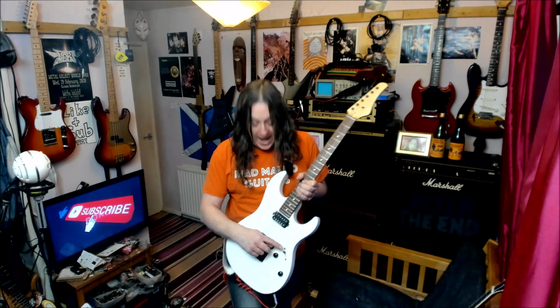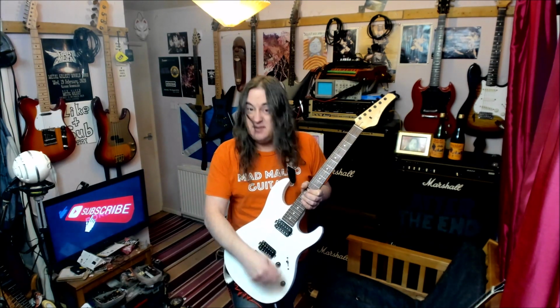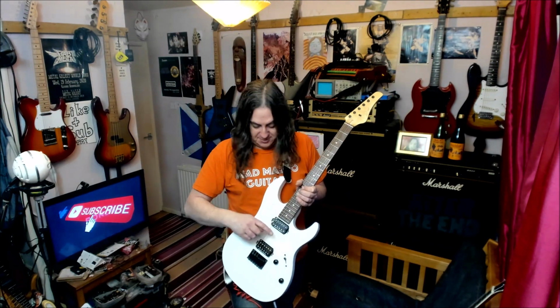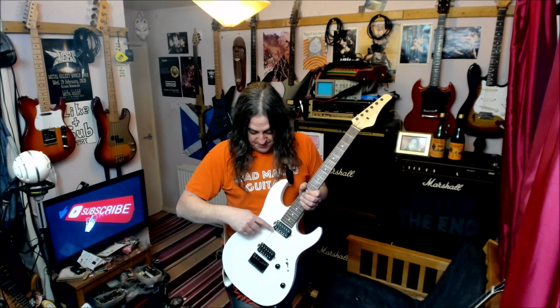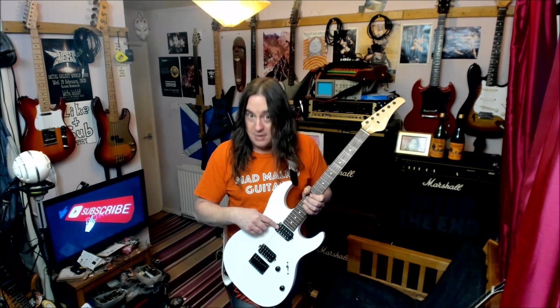So this is a special Ibanez 5-way switch, in which the outside pickups are the same, so it's still neck humbucker in position 5, neck pickup. Position 1 is the bridge humbucker, and position 3 is both humbuckers. But now in position 4 we've got this wired in parallel, not series. So it sounds 95% of the way to being a single coil pickup, but it's still hum cancelling, so it won't give you noise. That's definitely a single coily sound in it.